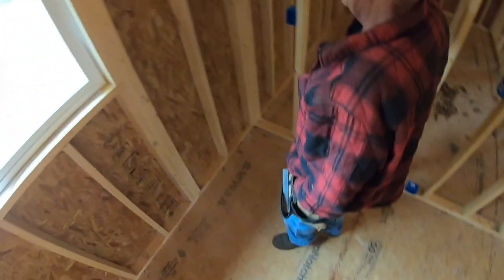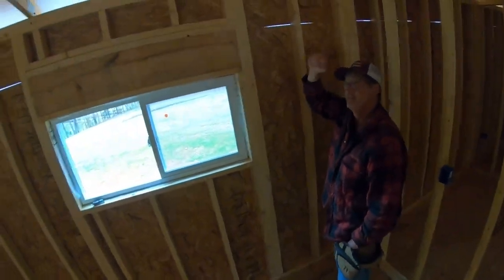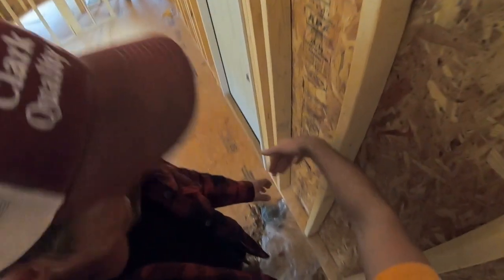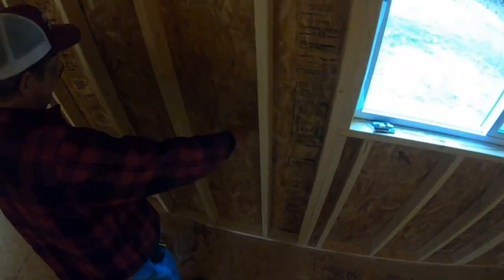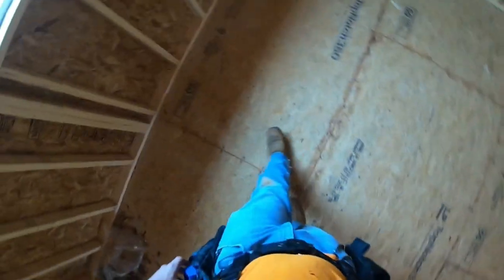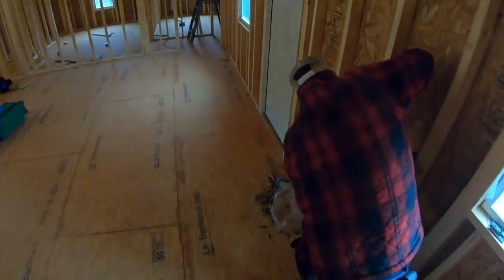I was putting that plug in right there, and I put the one right here for your switch for your sink light. From the end of the sink, wherever that is, all the way down to probably somewhere right there. Put two plugs over here. We already got it marked out. And then switch it right here. Okay. Now we said plug there, okay.